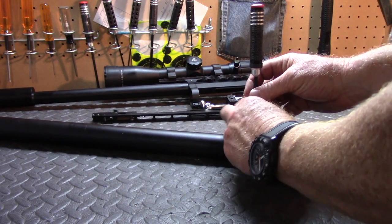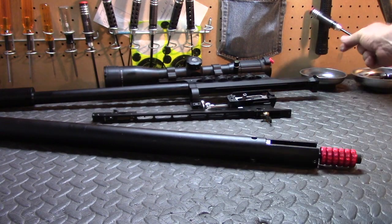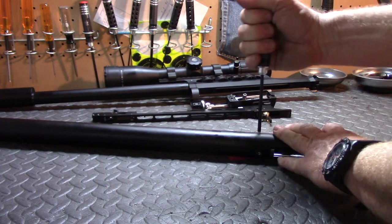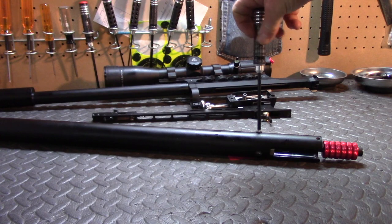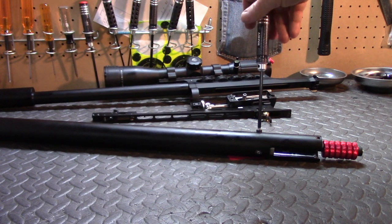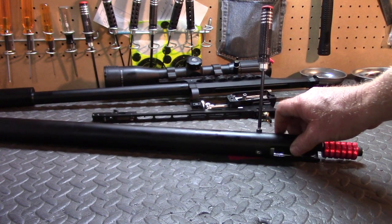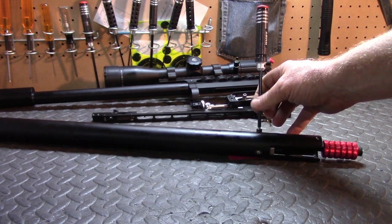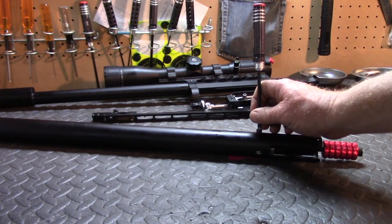You'll most noticeably feel it on the last screw. As you lift the head out of the air tube and the threads are exposed, you'll feel the regulator body start pushing on the screw. If you feel that, stop immediately and take your degassing tool and open the valve up again, just to make sure all the air is out. It only takes a little bit of air to send the entire regulator, plenum, and valve body along with your degassing tool flying, and it can be extremely dangerous.